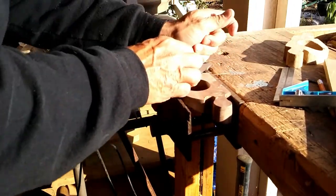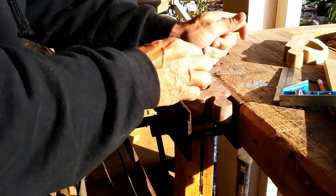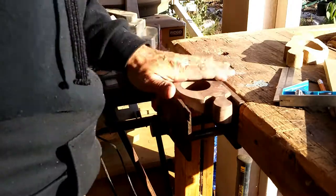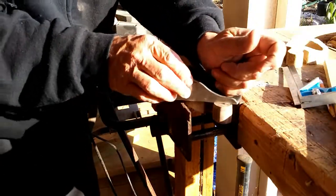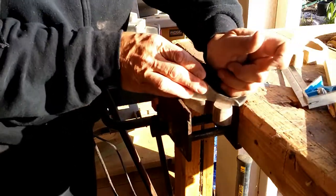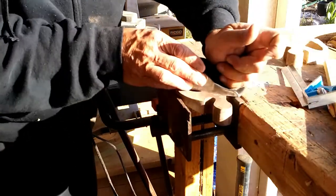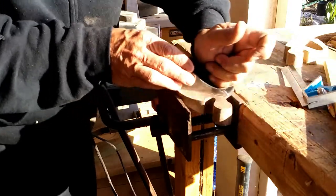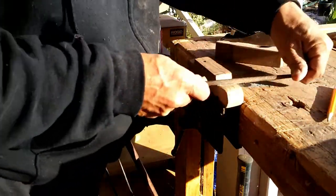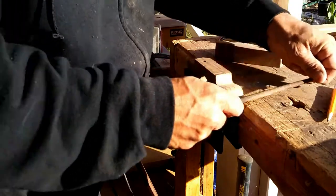Because of the need to stabilize the walnut, I ended up having to reverse the face that was going to be against the wood. Originally that face was already plain, smooth, and flat. But some checking that I thought I had stabilized brought up a problem, so I flipped it over to true up the bottom half of the edge — this was originally going to be one of the curved sides. Once I got this all trued up, I was able to curve the front of the walnut so that it matches the plans and the pallet wood design.